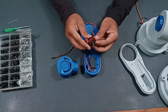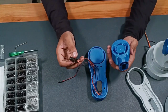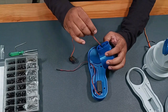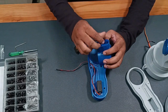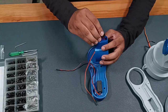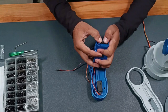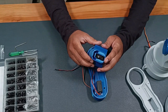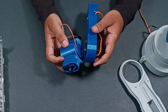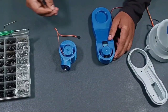For the flex arm, we need an MG90 servo — simply add it into the slot. Then using the servo cap, we can connect the flex arm with the lift arm. I'll add the servo cap into the lift arm using an M3 bolt.